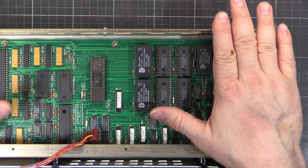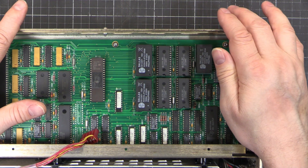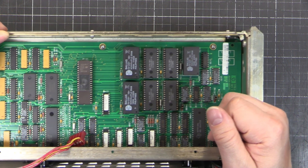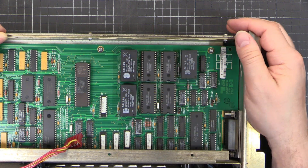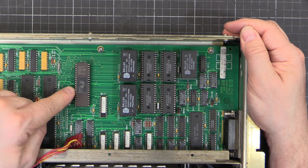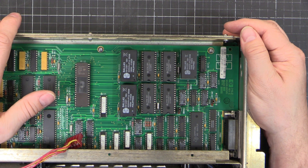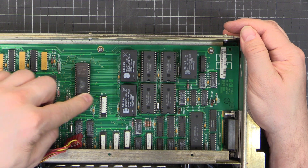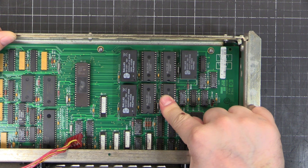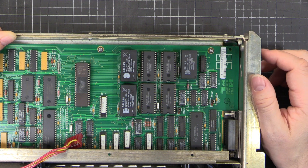This video won't be about doing a restoration or anything, because it's just a few plastic bits and pieces I'm replacing, the capacitors, and putting a new fan in. Nothing too crazy at all. But the one thing I'm doing, which is the subject of this video, is replacing the Dallas NVRAMs. I've put sockets in here already. This is the chip that holds the firmware. Earlier ones have more chips; this is a larger capacity chip. I've socketed it, upgraded to version 9.2, and put in option 001 - the expanded memory. I've also taken the chance to socket the Dallas NVRAMs while I had the board out.